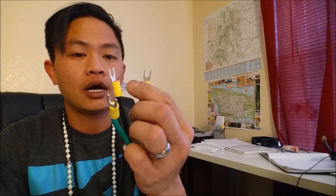So now I'm going to take a wire crimper and crimp them right in so they stay attached. Then I'm going to show you guys outside what it looks like when I connect this end of the cord. I took this end of the cord out and I'll show you how to split it up. There is some insulation — I wouldn't worry about it, you can cut it right off. Here are the two hot wires and here's the ground. I'm going to do the same thing, use these couplers on it, and then show you how I'm going to connect it to my breaker box outside the panel to receive 30-amp power.